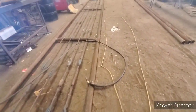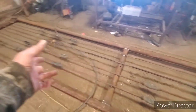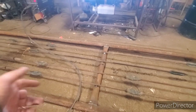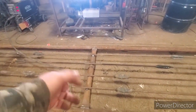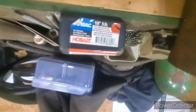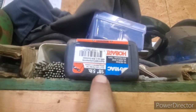I don't care what you say or what anybody says. You can't get a big enough weld unless you're maybe using 045 wire and just let it pool up as you burn it in. I built these with 7018 one-eighth rods before — these are what I use right here. 7018s, one-eighth rods. I have used these in the past and they work pretty good.